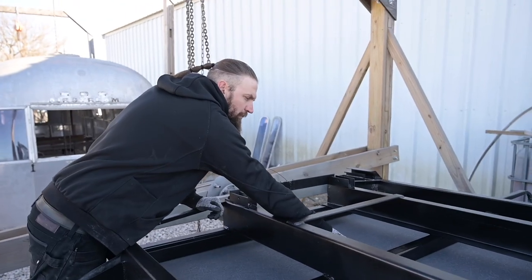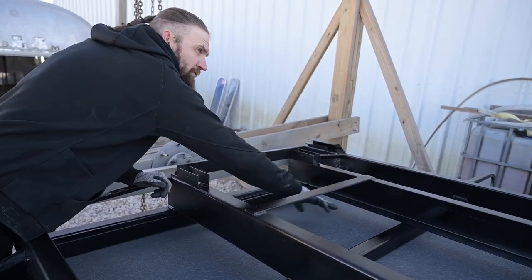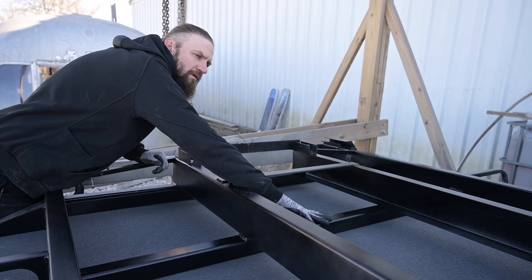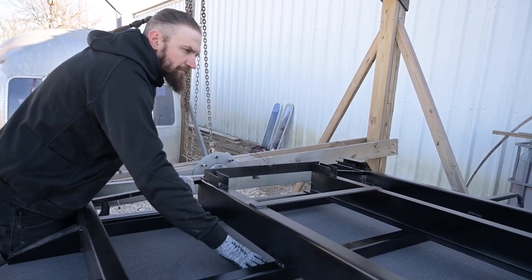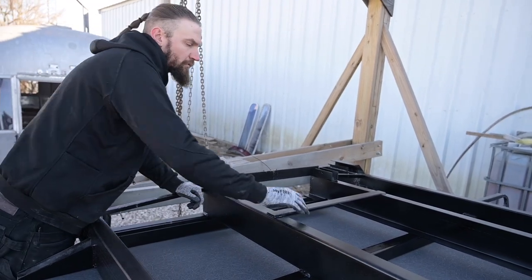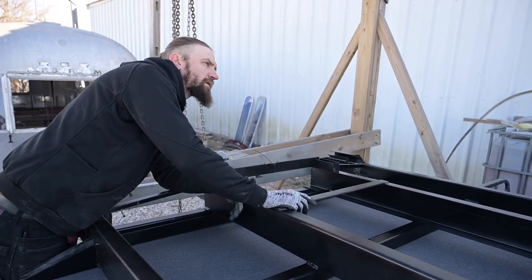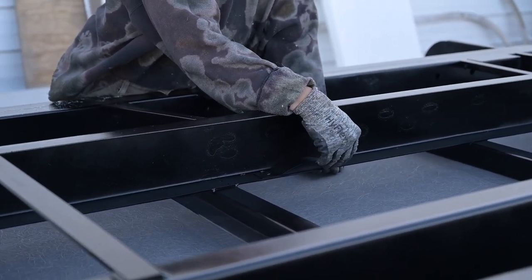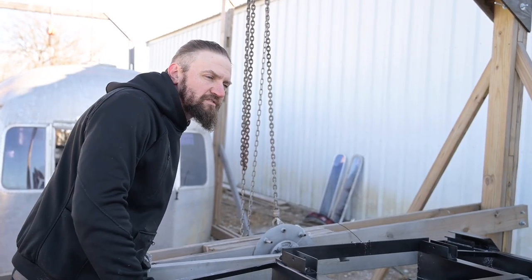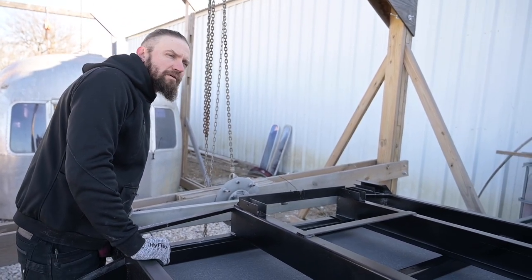All the ramp is here and we've got this open spot. We're gonna have a belly pan on the top. What I'm thinking is we'll probably need to put a strip of aluminum right along here where the ramp won't interfere with it. Then we'll probably use cut-out sections of pink foam and put them up underneath there, then put the aluminum over the top. We'll use rock wool everywhere else. It'll be better insulation right here where it's thinner — two inches there versus five inches out here. The aluminum will rivet into the middle section here. That just needs to be closed in, otherwise you can have critters, bugs, and stuff getting in there.